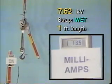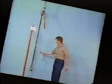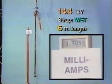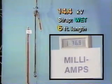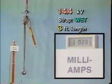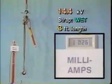Whether the strap burns through is not the all telling evidence these tests provide. Most importantly, they confirm that a nylon strap hoist by itself is not a so-called hot hoist. As the leakage current monitored on the meter shows, the strap conducts a significant current flow in every test, wet or dry.